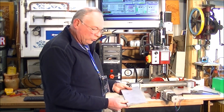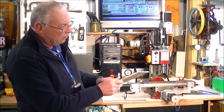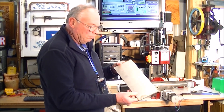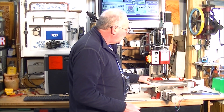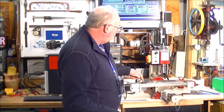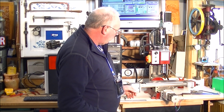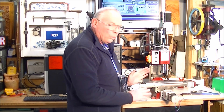So, what we are going to do today — what I want to do is make a fixture plate. This is about 7–8 millimetre aluminium plate, and this is nearly the full working area of this machine now. I've extended the working area by machining part of the base away. I've increased it by about 20 millimetres, which is three quarters of an inch.